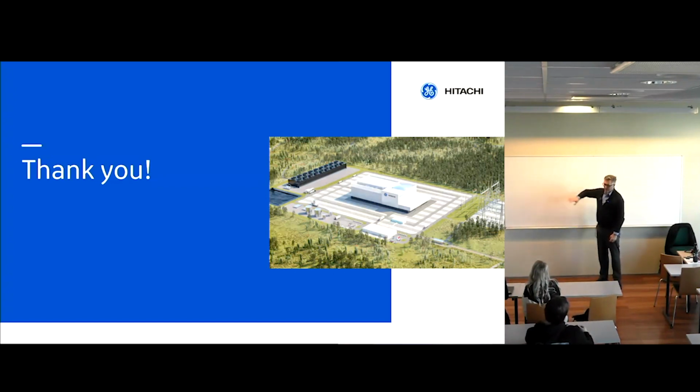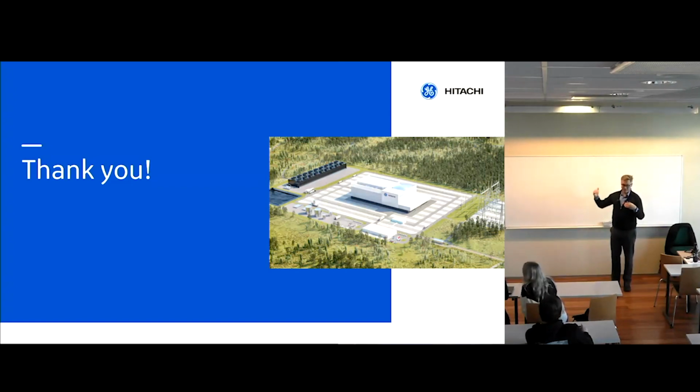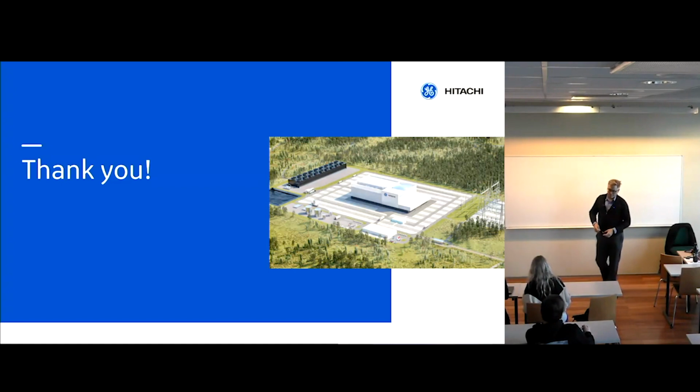Neutrons, now that's a different question. The neutrons are not affected by temperature, they're affected by the void. And so the void, if you have more steam than water, you have less moderation. Exactly. But it's actually really good to have that feature, because if the void fraction goes up for some reason, if you lose pressure or if power goes up, moderation will be less and power will be less, because you're basically going subcritical. So it's a very, very good self-regulating effect.